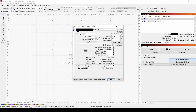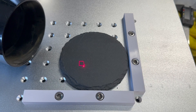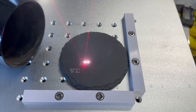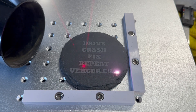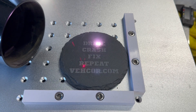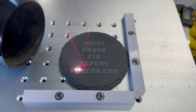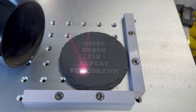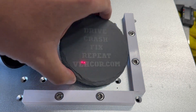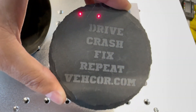For the slate coasters: speed 1000, frequency 25, max power 90, Q-pulse width 200, with three passes. I know that's pretty high power, but I wanted to get some deep engraving on this. At real time speed you can actually feel the engraving instead of just marking the surface. The contrast is really nice. This is where the fencing comes into play — you can just rinse and repeat. Once it's done you just pick it up, make sure it's the way you want it, place one down, and do it over and over again. Very simple and easy.